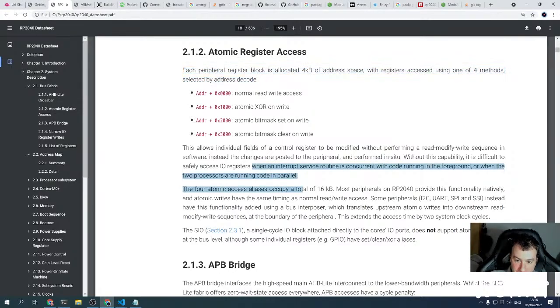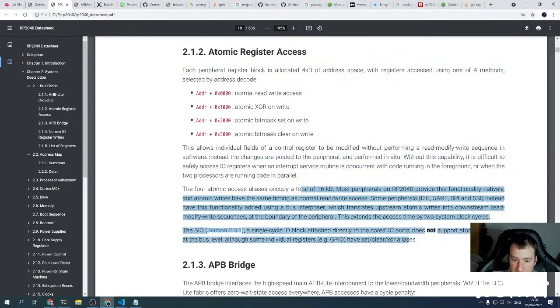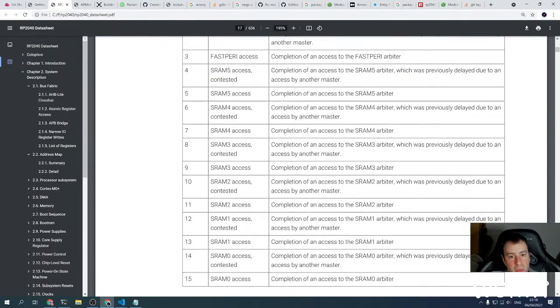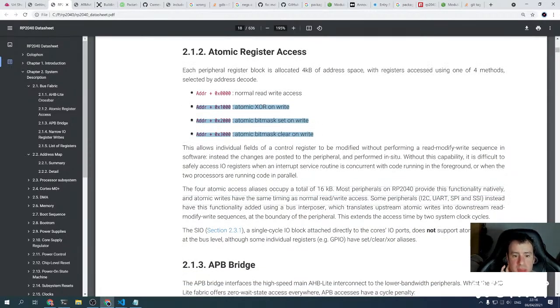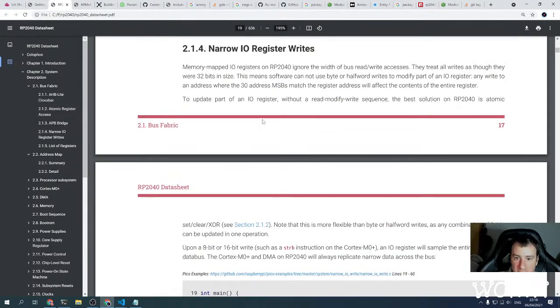So instead of just letting peripherals hook to wherever, we can define a way for peripherals to get notified when somebody writes to one of those addresses, and we can also implement all those behaviors in a generic way, instead of having every peripheral implement those special write access rules. Cool. Yeah, and this covers narrow register writes to memory mapped IO registers.